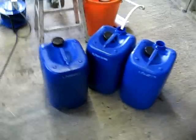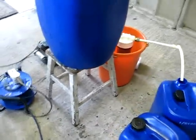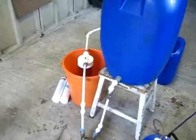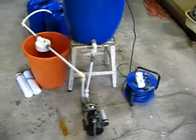The left hand one has already been filtered, two more to go. Once I've filtered through at 100 microns, I change the filter cartridge and filter at 25 microns, and then I'll do it once again and filter at 1 micron.